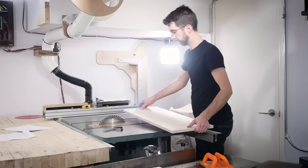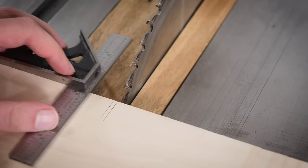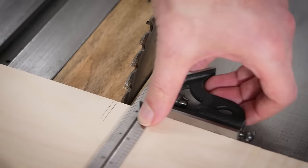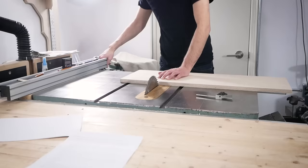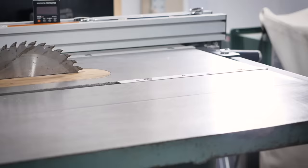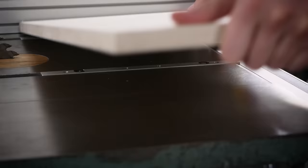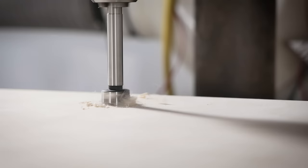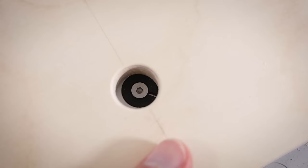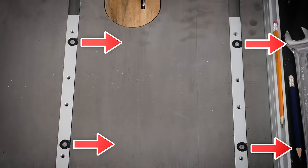To install the miter bars on the bottom of the base, I first need to establish the sled's position on the table saw top. I measured from the left of the sled and made a mark to show where the blade will intersect the base. Then I slid the fence from the left and secured it down where it touches the base — do not move this fence again. I placed washers in the miter slot so the miter bars sit just proud of the top. The most important tip is that the nylon washers must be oriented upward if you have a table saw with T-slot runners. This hides the adjustment screws, so I marked and drilled four three-quarter inch access holes in the base. Also ensure that both miter bar nylon washers expand in the same direction.